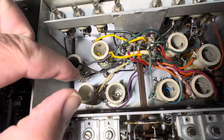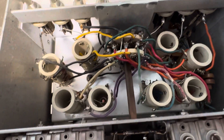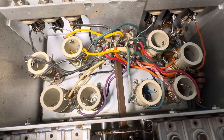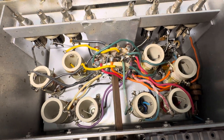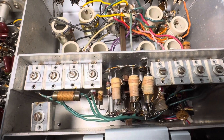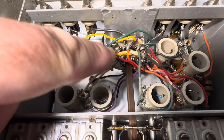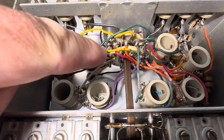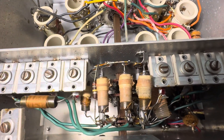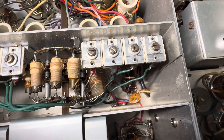There are little wires in here you can tweak with, which I heard you shouldn't tweak with. You tune these, I think, inside by bending wires — I really don't want to do that. We can thank Mr. Millen for that, because I read it doesn't change the Q of the coil to tune it that way. I did my best to clean these out, which is really difficult — you just don't want to break anything.